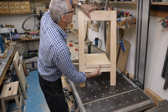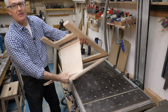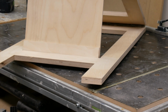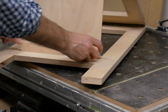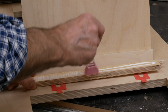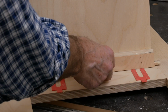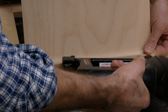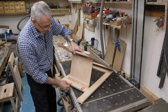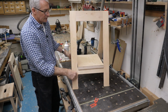And what we're going to do, flip this on its back so you can see it more easily. Okay, look at that around. It's much easier to see. What we're going to do is we're going to glue this in here like this, so that these little pegs extend over the edge a little bit. Now what I'll do is I'll pop in a couple of little 1mm packers, so it's not too tight. And that locks it in place.